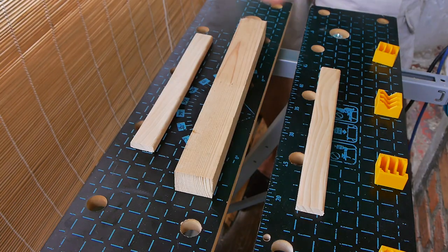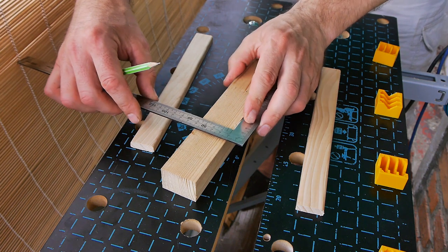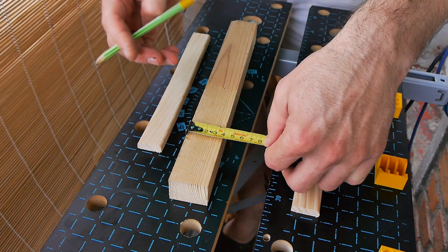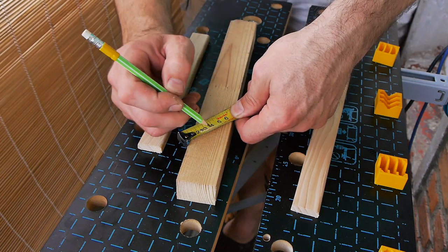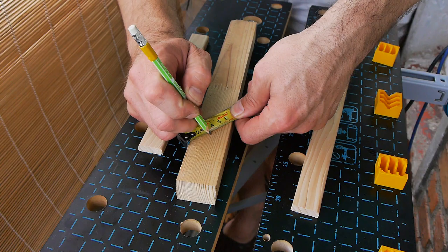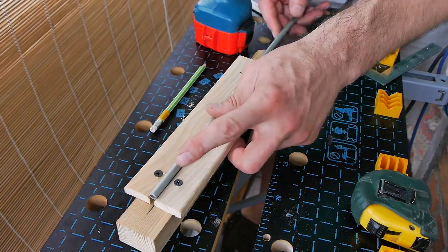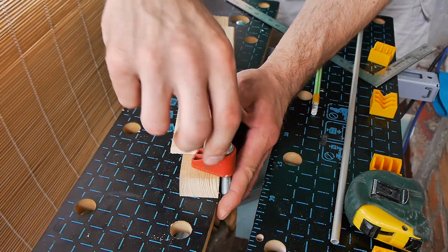To begin with, I will make a little gadget for more comfortable work. Here you can find the middle of the timber blank with a trisquare or a ruler, or you can apply the division method which I already described in the video about tape measure — it will be much faster. We assemble our tube holder and fix it with clamps, then fix our timber blank.